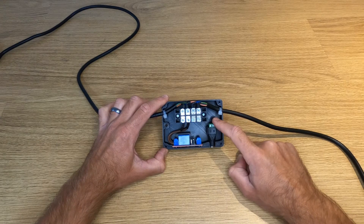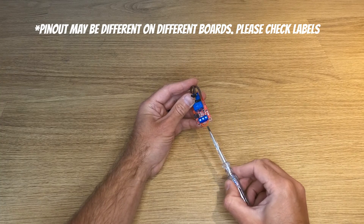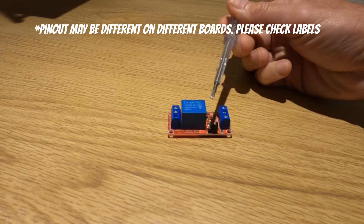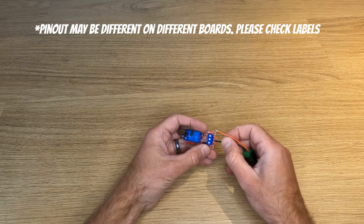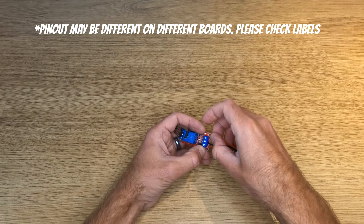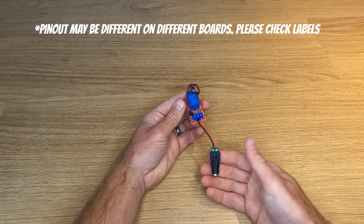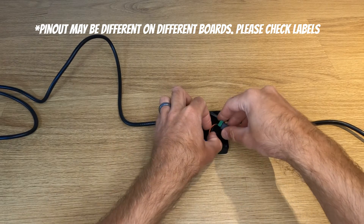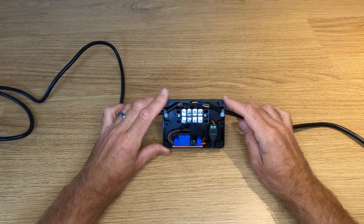The last thing to connect inside the case is the 5 volt feed side. This wiring connects the 5 volt socket to the relay so that it can actuate it. We need to create a connection between the DC plus terminal and the in terminal — I did this with a small piece of wire. Leave the relay jumper pin in the high position, which means both pins need 5 volts for the relay to work. Connect the negative wire to the DC negative terminal and the positive wire to either of the outside terminals we just connected together, then connect these to the socket and push the plug into its position in the case.